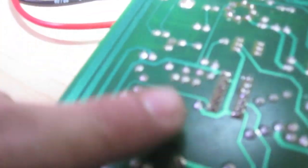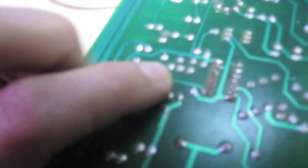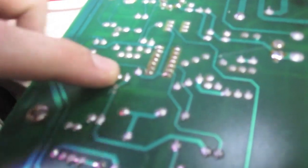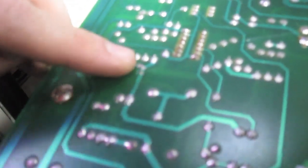What you want to do is put the part through the holes after you desolder them, and you're going to melt this metal. It turns into a liquid with your soldering iron, and you're basically trying to adhere it to the metal. What's important is that we want to heat up the part first and not the solder, then push the solder onto the part and it'll kind of suck into it when you remove the iron and when it cools.